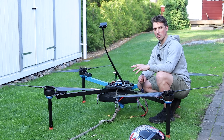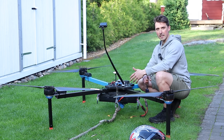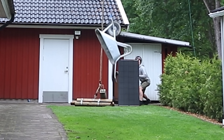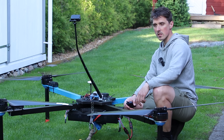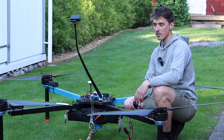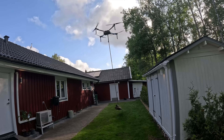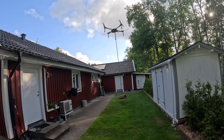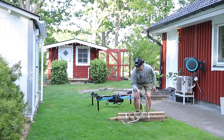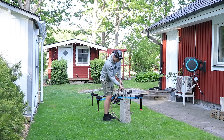In part one of this drone build, this was 22 kilograms, mainly because we used lithium polymer batteries. Now we've added 10 more kilograms of extra battery, so no wonder it's much heavier. We've also added a drop mechanism, another battery, the GoPro. What it did in this clip is actually quite insane — not only does it lift itself at 35 kg, a wheelbarrow at 12 kg, but it ragdolls a tether weight at 60 kilograms. So that's more than 100 kilograms, and that's about 25 kilograms per motor — about 100 kilograms of thrust. Okay, doing 20 kilograms. We're doing 40 kilograms. This is probably where something goes wrong — if the propeller doesn't blow, something else will.